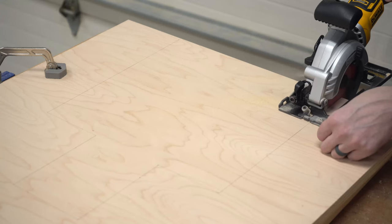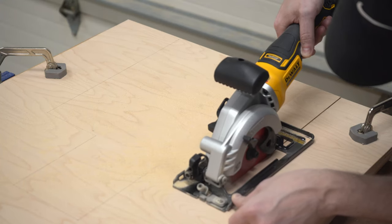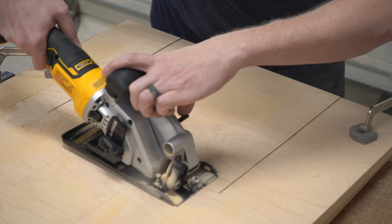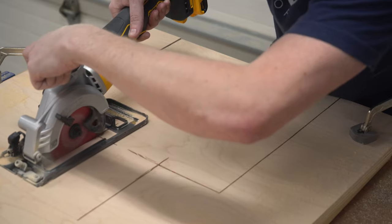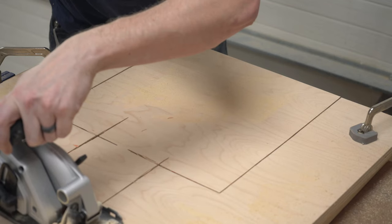You may have noticed this odd shape in the back of the cabinet. Well, the top part is cut out to allow it to slide past the router and dust collection box. And the lower part is cut out because of how close the table saw motor cover was to the back of this. I needed more space for the 4-inch hose.